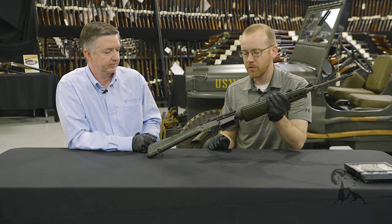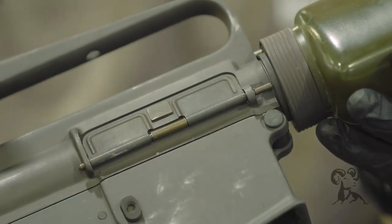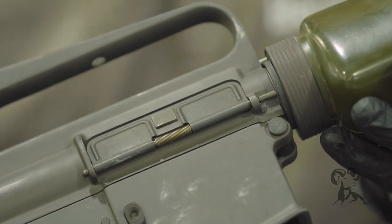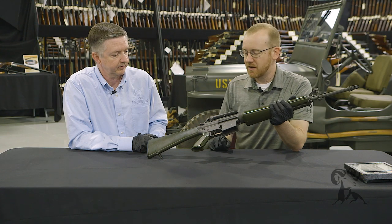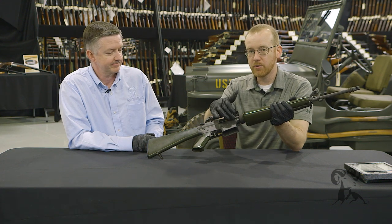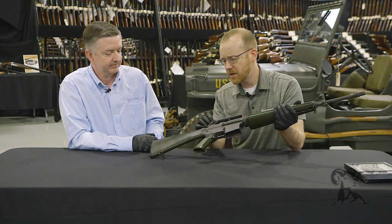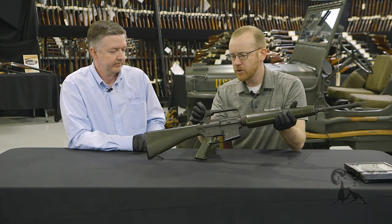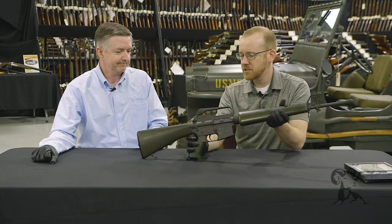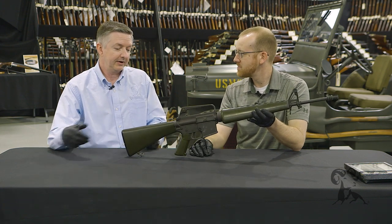There's also one more distinctive marking that's really tough to see — there's a cross, a plus sign, on the original 601. I don't personally know the backstory on it, but if you're looking for an original-type lower, the Brownells lowers from Nodak have that marking as well. A few other nuances: the rear sight drum isn't quite the same as the A1, just slight design changes made along the way to simplify things.